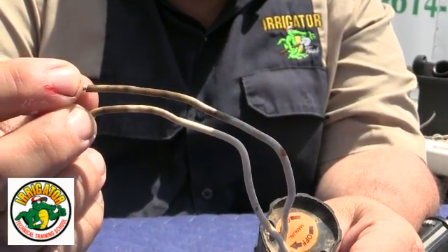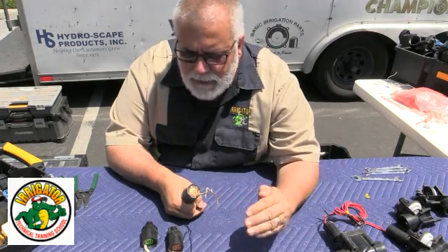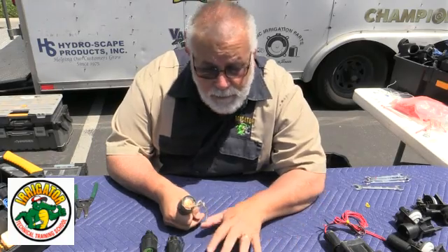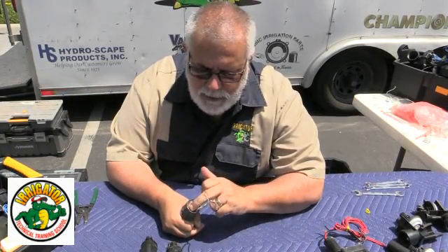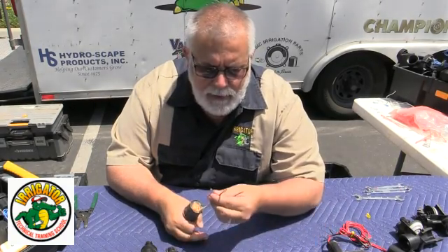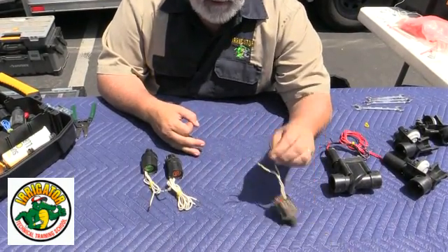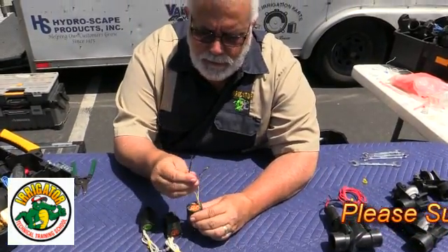Then it starts burning the wire back. Right here we cut it and replaced it — put a new solenoid on. But I've had these burn back five or six feet, and people say, 'I've got a wire break.' What it is, is on any type of solenoid in the field, if you turn off the water and still have the solenoids coming on for 10 to 15 minutes every day, and they're not cooled off — this overheats, it starts to bubble on top, and then it starts to burn up. Even if you took a piece of wire, put the solenoid on the end, put 24 volts on it with no water, it would burn up the wire — overheating it, changing the molecules on the wire — and you'd have to replace your solenoid.